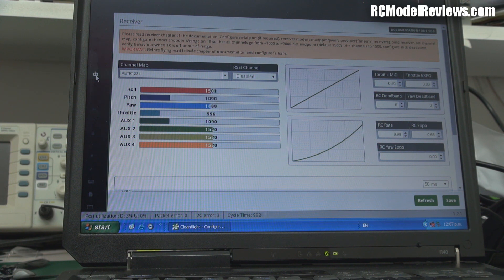I wonder if the other controls are similarly affected. The pitch control seems okay. The roll control — let's try that. Roll seems to be fine, fluctuating to a maximum of about 1503. But that left-hand yaw channel is reading 1511 to 1513 — way up. This radio is a dud. It just doesn't centre on the yaw, so it's going to be really hard to fly because it'll be constantly yawing on me.